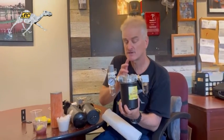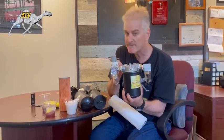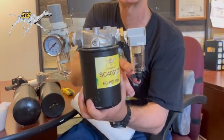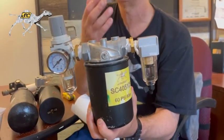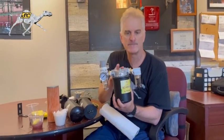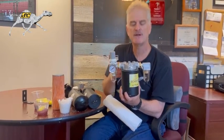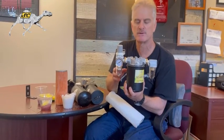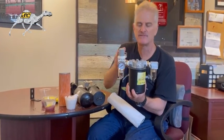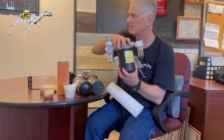Simple, but for one reason or another, your compressor may be spitting out a lot of water. Some of the droplets are really fine. We have this guy over here. This is called a moisture indicator. This will get the fine droplets of water, and it'll tell you, hey, you got a problem. You should probably change your filter or check your compressor. Maybe you haven't emptied it in a while. This is for Cerakote guys, coating guys, circuit board people, anybody who's doing precision coating, fishing lures. We have a lot of fishing lure people, and some sophisticated body shops who just hate water. So again, this is $245. You get the regulator, water trap, head, 2 filters, and the moisture indicator. Very popular.